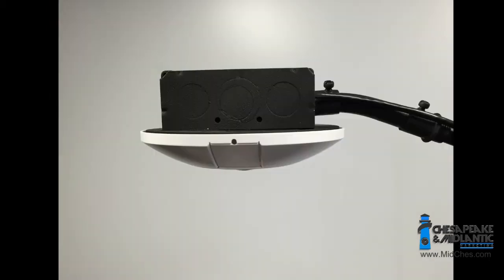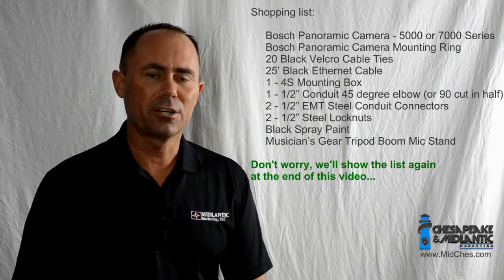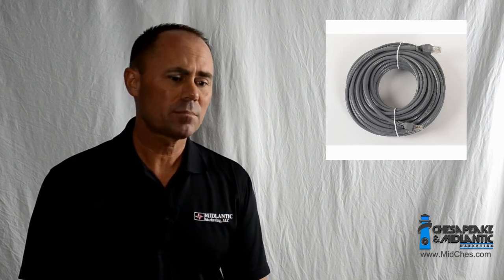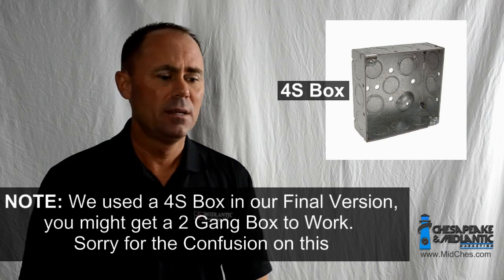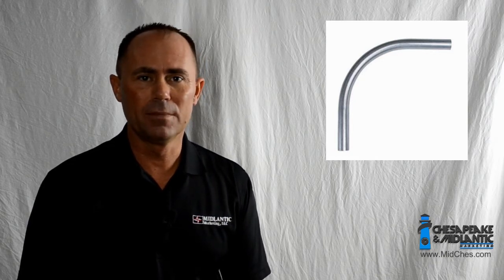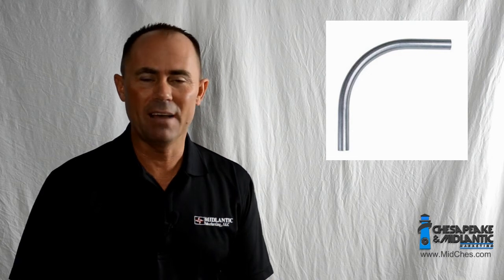So that's what I want to present to you. What we did was we took a mic stand that we got from Guitar Center — you can probably get it just about anywhere. In this case it was called a Musician's Gear tripod microphone boom stand. We also have our Bosch 360-degree camera, in this case it's a 7000 series. You're going to need about 20 Velcro straps for cable management. There's a 25-foot Ethernet cable — you might want to get one a little shorter or longer depending how far away the camera is going to be from your network switch. You'll need a two-gang box, a 90-degree conduit cut in half to make a 45-degree. What I found is if you go to Lowe's or Home Depot, they don't have a 45-degree conduit bend, so you'll have to cut one in half and make a 45-degree.